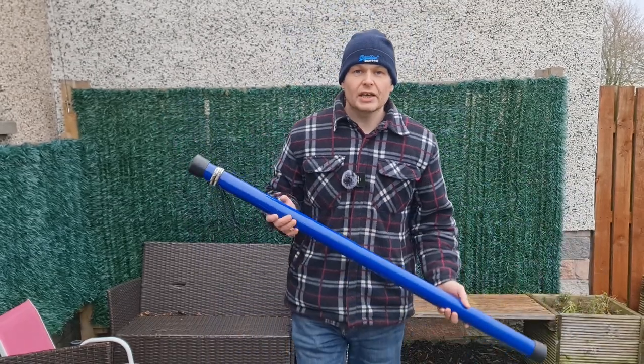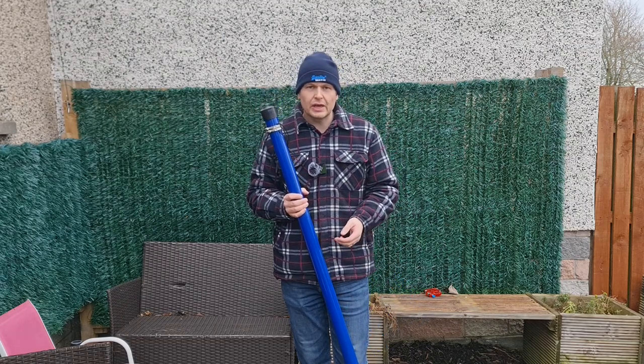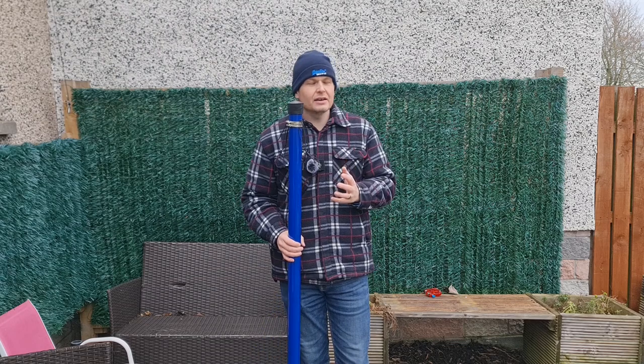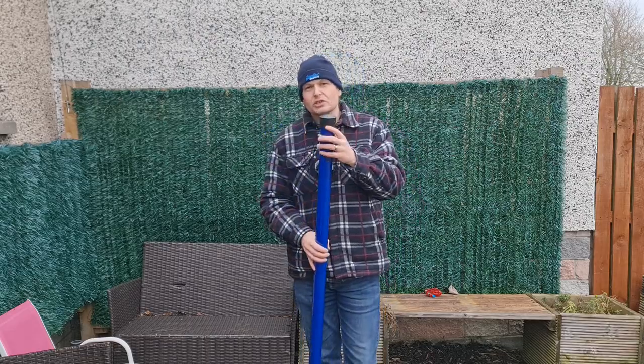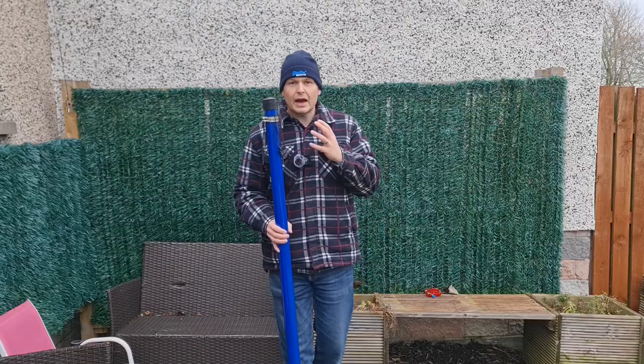That's important because you do not want to use any sort of clamps on fibreglass poles. I mount this at a low level — obviously this pole is 1.2 metres long, so I'm quite confident, for short periods of time, of guying it at this lower level and using it as is without having to worry about guying it further up. I've been using this for my 10 metre Moxon antenna, which weighs about 1.2 kilos total, at 6 metres off the ground — clamped at the 6 metre point, guyed at the bottom with nothing else, which I think is quite incredible.